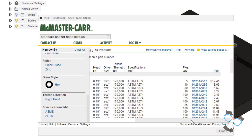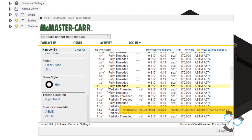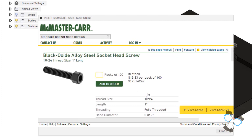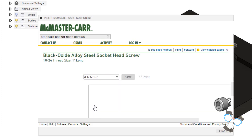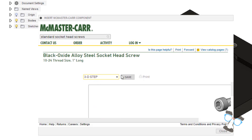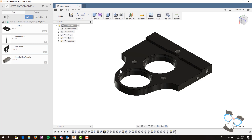Let's say I fancy these one-inch-long number 10 screws. If I click on them, I can go to the CAD product detail. If I'm ready to select this, I can go to the product detail CAD button. Following this, I can scroll down to the bottom of the page and save this as a 3D model — let's say I want to use a STEP file. I can hit '3D STEP' and then save. This will import the part into your 3D model.